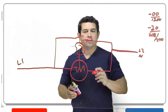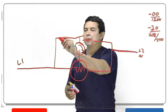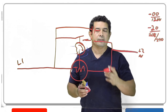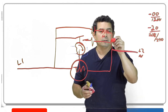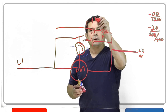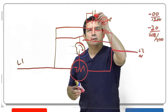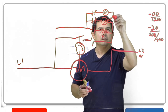So on here, this solenoid is going to work just like a relay. What they have done is they will come this way and have a normally open switch — that normally open switch went to the heater. From the heater, we take it here and it goes out this way. Also, they come here and go to a normally closed — that normally closed was going to the compressor. Then there was another normally closed that went to the fan. Both of these connect like this.